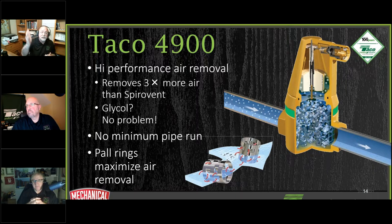In fact, just give us one example. What size do you use quite a bit? Is it one inch, inch and a quarter? Yeah. I think it's a CV of 27 on a one inch? Yeah, well, a one inch is 24. Yeah, 24 air separation. Again, less than the same length of pipe. So no. Right. Yeah. Yep.